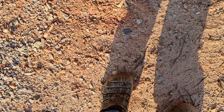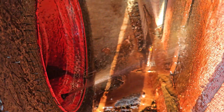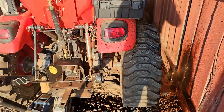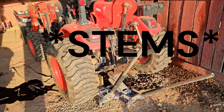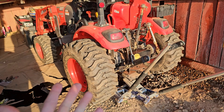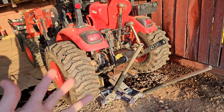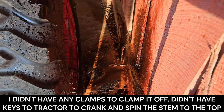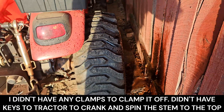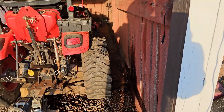It sucks. Got it all over me. This is ridiculous, it's a damn shame. Guys, you got rubber valve stems and beet juice in it — change out your cores, that's going to happen. This tractor is now four years old and both sides have done the exact same thing when I went to go check the air pressure. As soon as you twist the cap to take it off and check the air pressure, the whole core and everything comes out of these things.